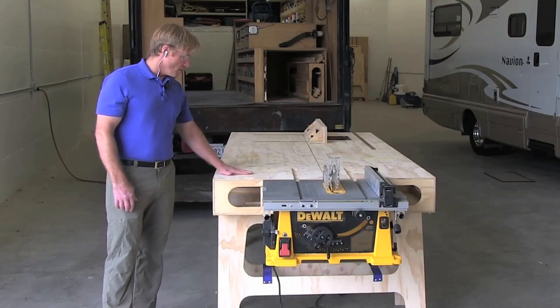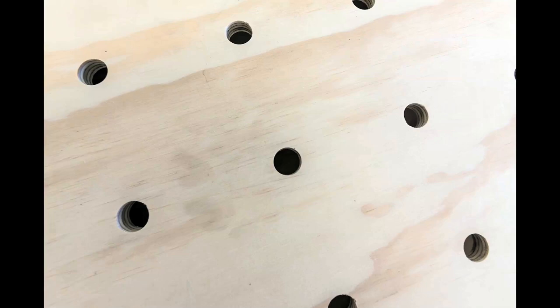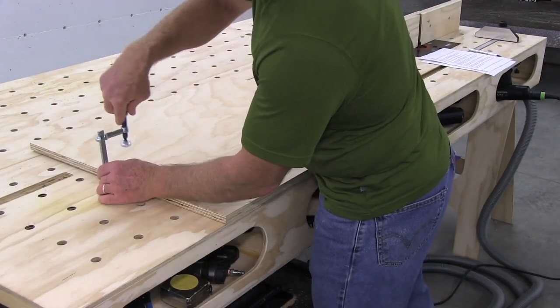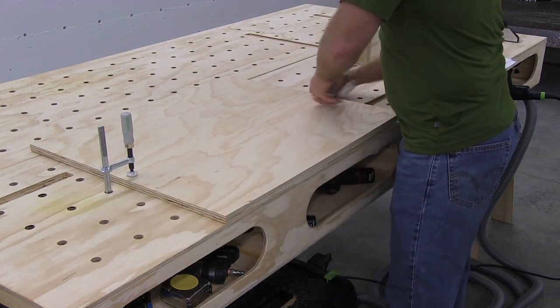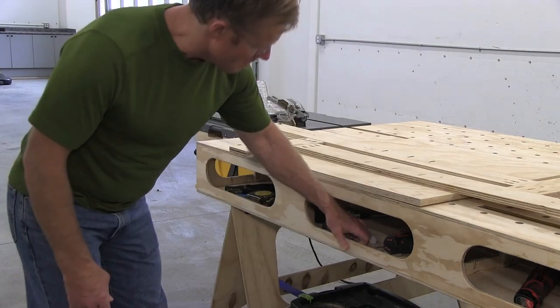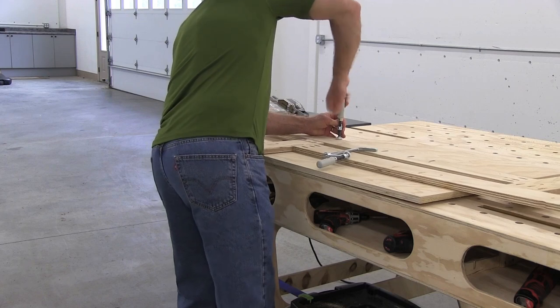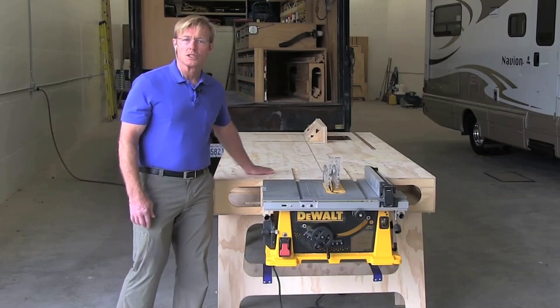And tell us about the perforations on the work surface. The perforations are not original — they're bench dog holes. You'll find them on lots of benches. I set them up so they're four inches on center and they cover the entire workbench surface. They allow me to clamp anywhere on the bench that's necessary. I happen to use the Festool C clamps, but they drop right in the holes and I can clamp down for gluing or screwing something together. I can also attach any number of fixtures that I build out of wood on the job, just to hold things down, or templates, guides, things like that. That was the purpose of the holes — just to be a clamping surface.